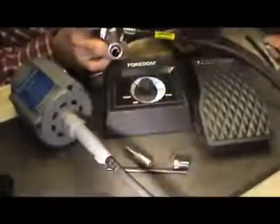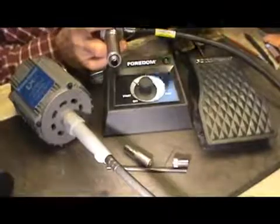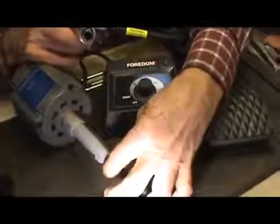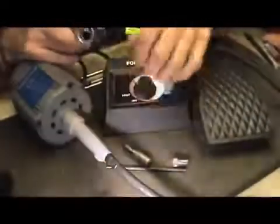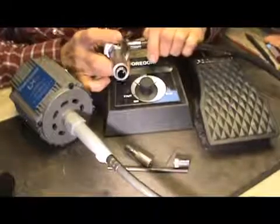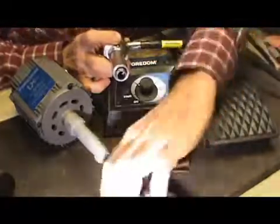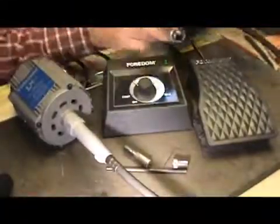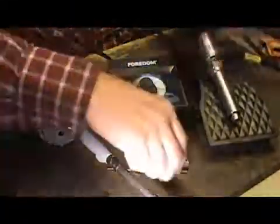And when it comes down, it doesn't allow that shaft to go all the way in there. So just occasionally look at this. If you ever have a problem, loosen that set screw, push this cable all the way up, and retighten it. But that's pretty much about the only thing. And generally what happens is when the thing gets pulled around and something gets pulled, it'll get pulled loose from that. Okay, so we've got the mallet.